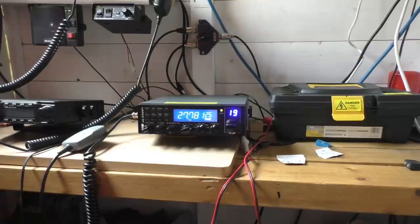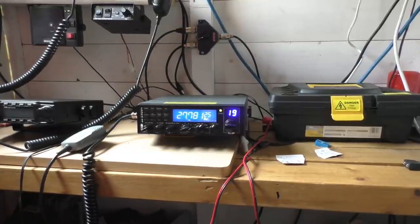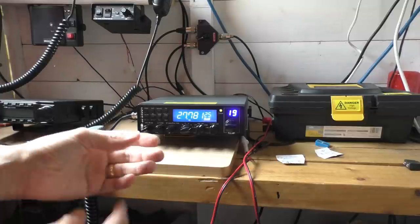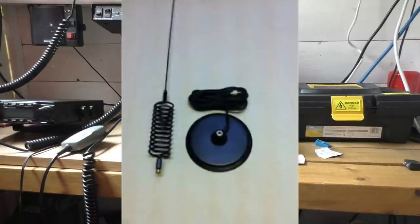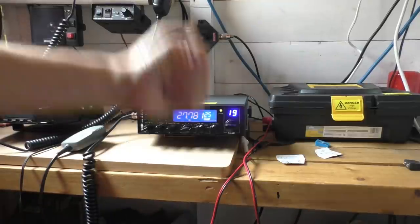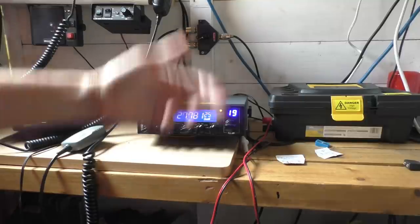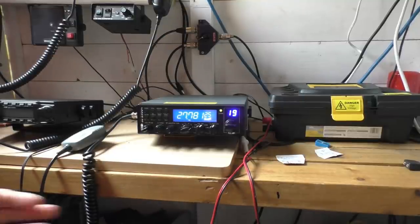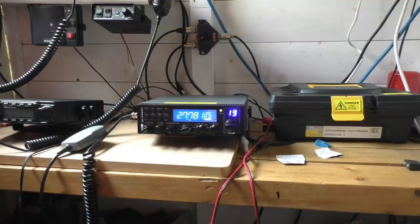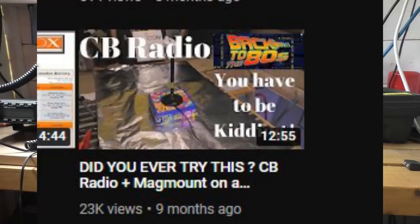If you're going to be home based, like a lot of you are, because a lot of you've got families now and work commitments, ain't like the old days, is it? So yeah, you're home based. Please don't try and start and use just a simple springy mobile antenna, or maybe an old sort of Defender antenna mobile that you had in the past, and stick that on a radiator in your dining room and hope to get out. It's not going to work like that. In the day, you could stick it on a biscuit tin. I did do a video on that recently. It still works.